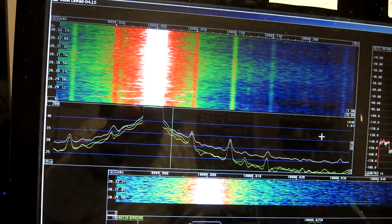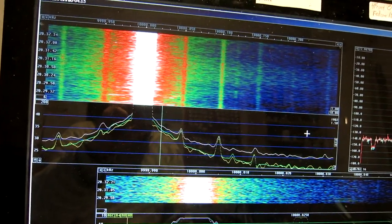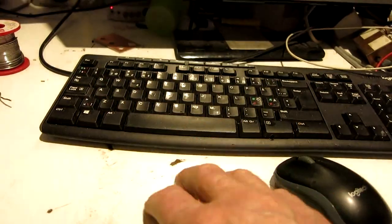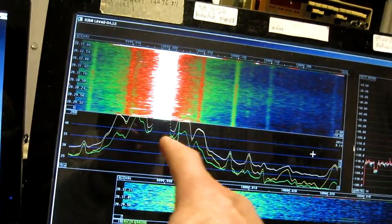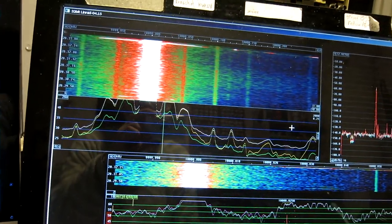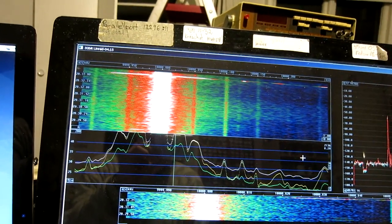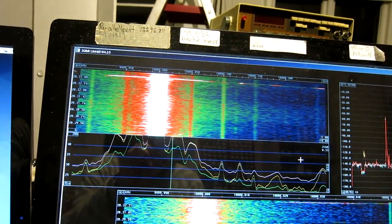Here I am running the amplifier in the interferometer. There are two problems. One is mechanical stability — if I tap on the table like this, you can see I get very strong sidebands, some 20 decibels or so.